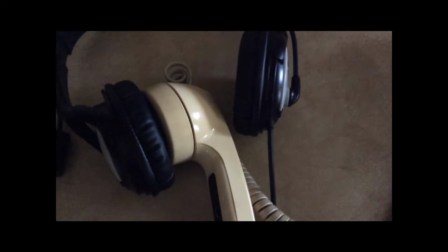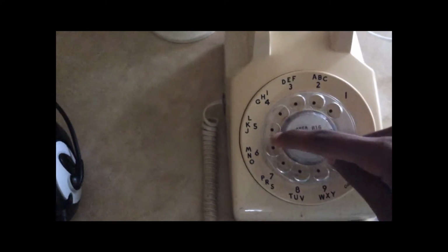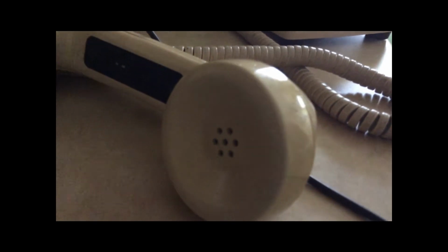So as you can see here, I have once again coupled this telephone handset's mouthpiece to this headset here, which is now plugged in. And the phone is not happy because it has been left off hook. It needs to be in order for this coupling to work. But we can now dial the CNET number that allows for blue boxing. So we'll start with 2600 Hertz, KP, and then the numbers.